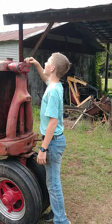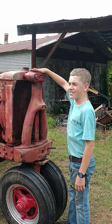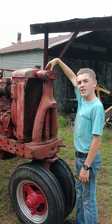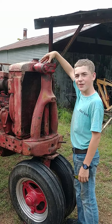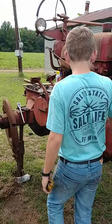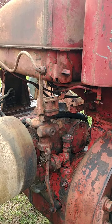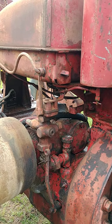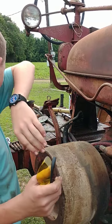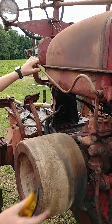I don't know what condition this steering is in. That's your steering — the sector gears in here, and then there's a worm gear. Sometimes it's worn round, and when it's messed up you can just flip it over. And then this — you wanted me to explain the hydraulic system. Normally there's a linkage that you pull up, and they've got a tape wire wrapped around it pulled up, so it's putting pressure there constantly.